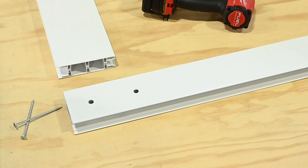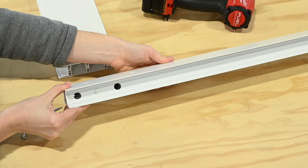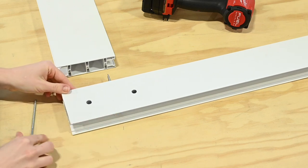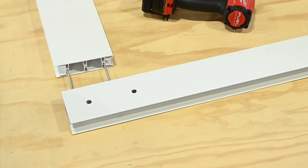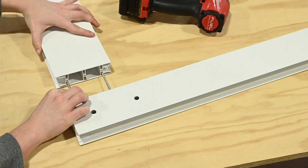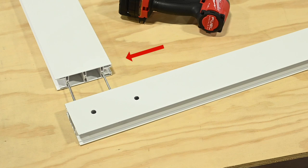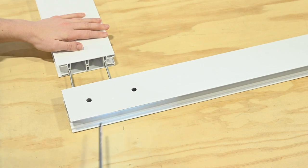To assemble the door, lay one of the stiles onto your work surface. Make sure the side with the large holes is facing outward and the pre-drilled holes in the stile surface are at the end you are working — this will be the top of the door. Place two of the 4-inch screws into the two holes in the outside of the channel, making sure they are fully inserted through the stile panel. Line up the top rail with the stile, making sure the side of the top rail with the thinner channel is facing down towards the bottom of the door. Place the end of the top rail against the screws, lining up the holes in the extrusion. Once in place, continue tightening screws until stile and rail are flush and secure.